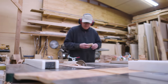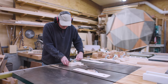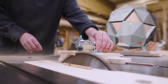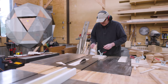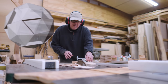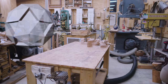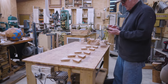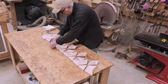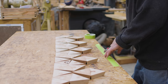I can move all the triangles to the table saw and cut the angles between the triangles. With this geometric shape there are two different triangles and three different angles between them. There's a set of five that make a pentagon, and between the pentagons there's an equilateral triangle. And I can lay everything out flat. Then I can get ready to glue the pentagon sections together.